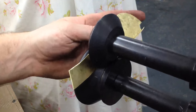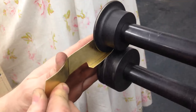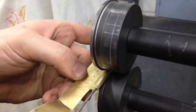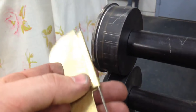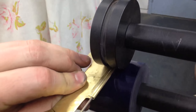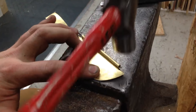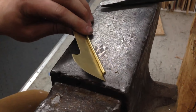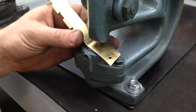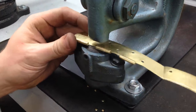Here we are using the bead roller to put the hinges on the front for the folding front faceplates. Switching dies a couple of times requires a little bit of work but basically folds it over a wire, so you get a nice even rounded tube that will be cut into a hinge. There's a little bit of hand work still involved with this. I'll use my Whitney punch number 16 to punch some 1/8 inch holes into this hinge before it gets installed onto the helm.